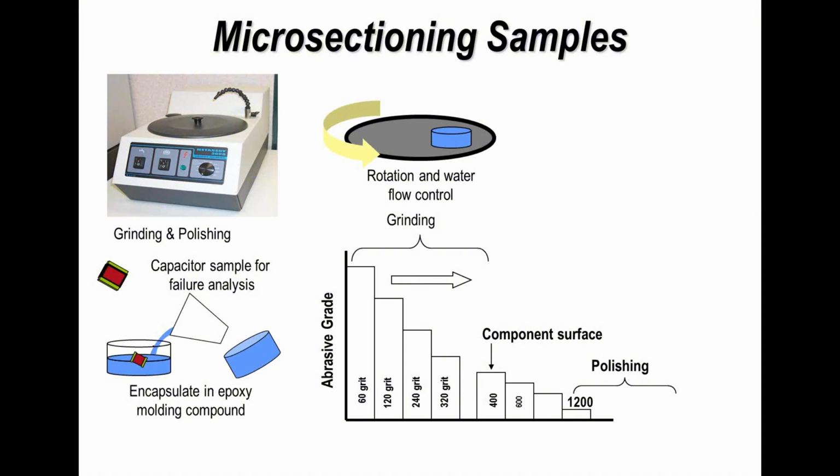With the wet and dry paper, we're basically using finer and finer grit. As you can see on the diagram at the bottom here, we're going from perhaps 120 up to 600, 800. In fact, we normally go up to 1,000 with paper, using water and slowly grinding the section, and then we go on to a polishing stage. But normally you go up to 1,000 grit to get the best finish prior to going into the next stage.